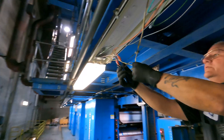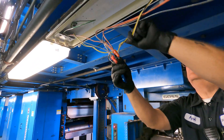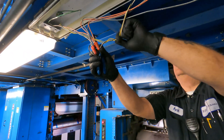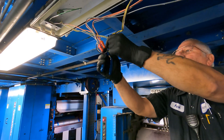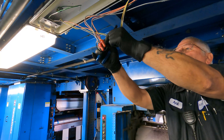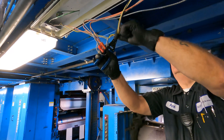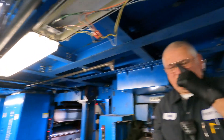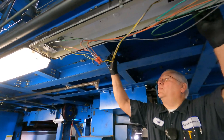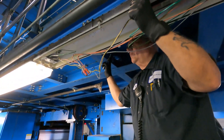First thing you do is isolate. You see it coming off the pot — these are your pockets coming off. I want to leave me a little bit to play with, so instead of breaking it here, I don't lose my lights. So you're just going to cut it — cut it and leave me a pigtail. I see, and then you'll just tie into that. I got to get up higher because the light blinds me and I can't see, so I got to work from up above it.